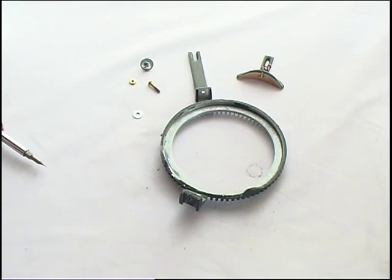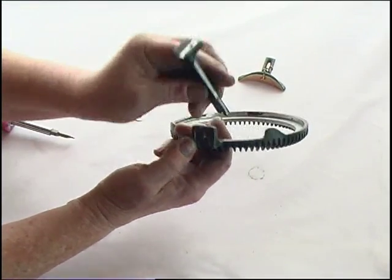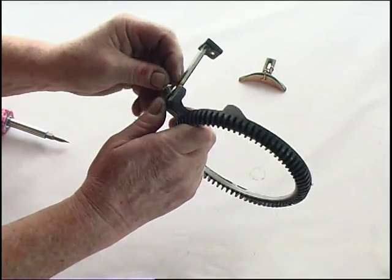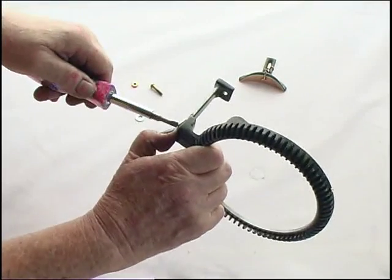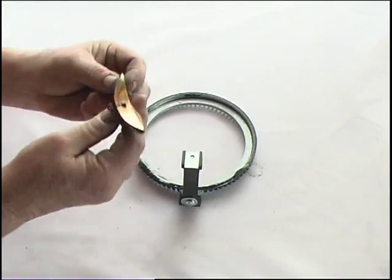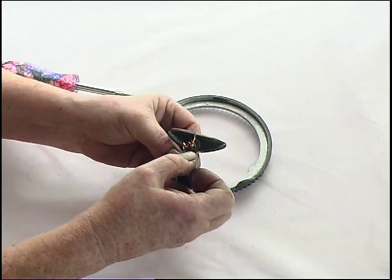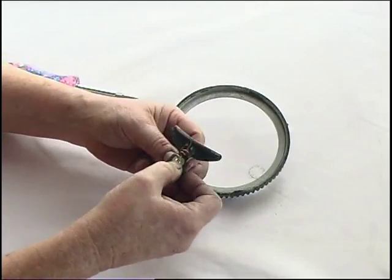This is the assembly of the gear ring, and this is very simple and straightforward — you will do your adjustments later. First take the gear ring and fit our yarn guide, which must face back in that way. If you face it around the other way, you won't be able to knit. We then put the washer and the screw in. Take our yarn guide with its screw and washer, down into the hole in the yarn guide stem. We're not worrying about any adjustment at this stage, just getting it together and putting the little nut on the back — just finger tight at this stage. Pull the little pigtail back; that little piece is the pigtail and it holds the yarn in the guide.